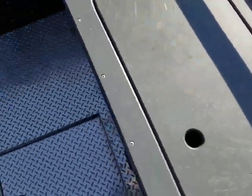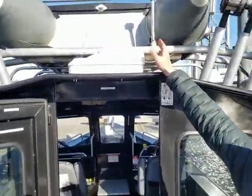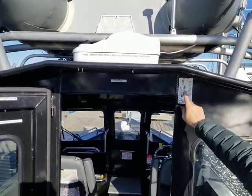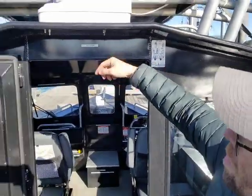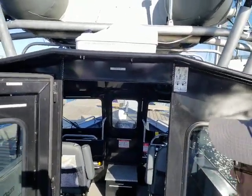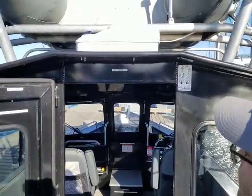We're getting closer here. The EPIRB is up here. That's an emergency beacon that's triggered. It sends out a distress signal with your location for the Coast Guard. There's instructions here on how to access it. Basically, twist the blue dial, lift the lid off, and then you can pull the unit out and hit activate on it to start transmitting.